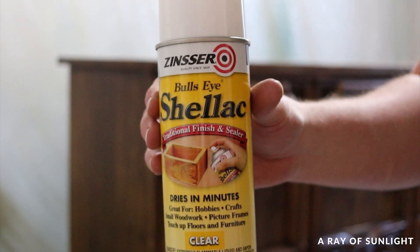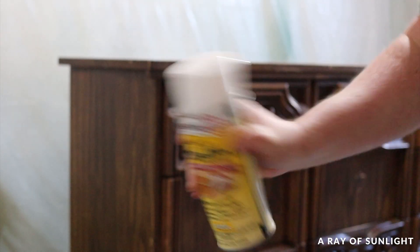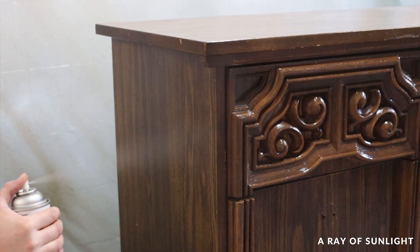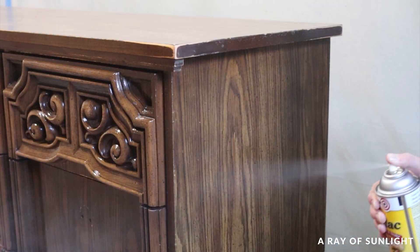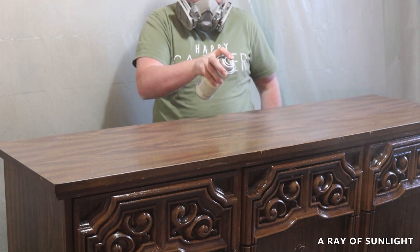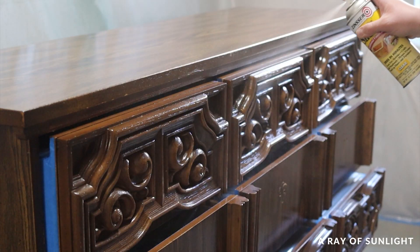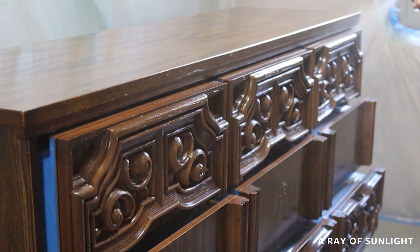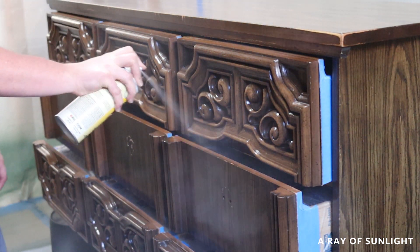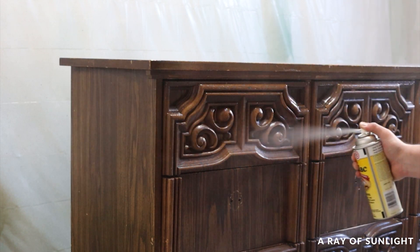Then I moved it into the spray room and sprayed two coats of clear shellac on it, waiting at least an hour for it to dry in between coats. Since this dresser is mostly laminate, we didn't really worry about bleed-through. But we did need to worry about the paint adhering. This shellac somehow does a really good job of making paint stick to slick surfaces. And yes, even chalk paint needs help adhering to laminate. We didn't really want to have to scuff sand all of those details — that's why Taylor prepped the dresser.